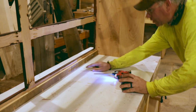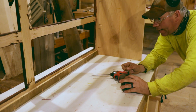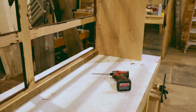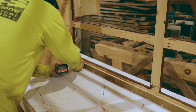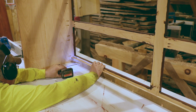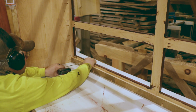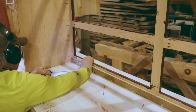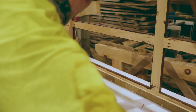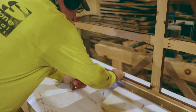So I put the stretcher in here, and if you can see, I've got pocket holes so we can come from down below and screw into that plywood bottom. I know a lot of you think the Kreg system's cheating and all that, but I tell you, it does a good job and it makes things really strong. Much better with a fresh battery.